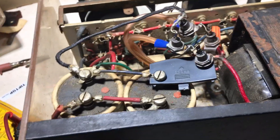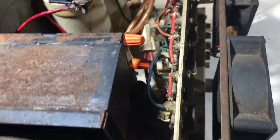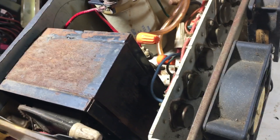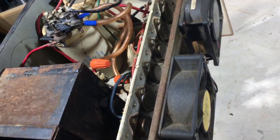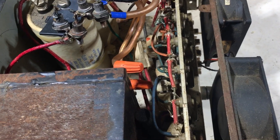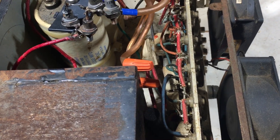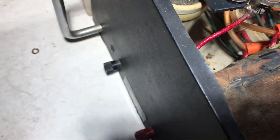So that's about it folks. All laid out on that one heat sink — you can see the way they're all laid out there, the way the two fans are mounted. If you do use two fans and try to wire them in series, make sure that they have roughly about the same current draw — that way they'll run at about equal speeds. If they're mismatched on the current draw, one will run faster than the other one. So two of them are running roughly about the same.